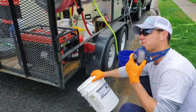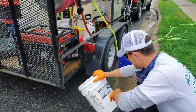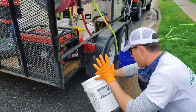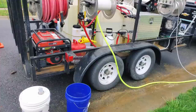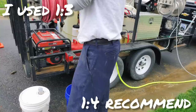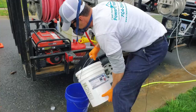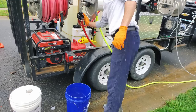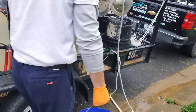The label also says it could be fatal and cause lung problems if inhaled, so you want to make sure you have a good respirator with chemical vapor protection filters so you're not breathing any of that harmful stuff. So from reading the label: rubber gloves, safety glasses, and a respirator are the PPE you need. We're going to mix this up — I'll put my respirator on, then we'll mix one gallon of CleanSal BC to three gallons of water, a one-to-four ratio.